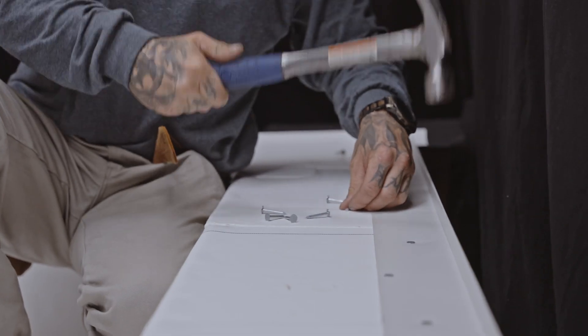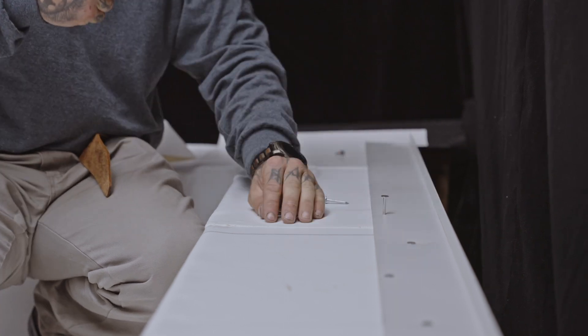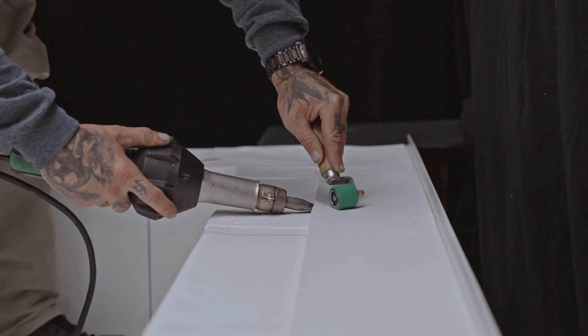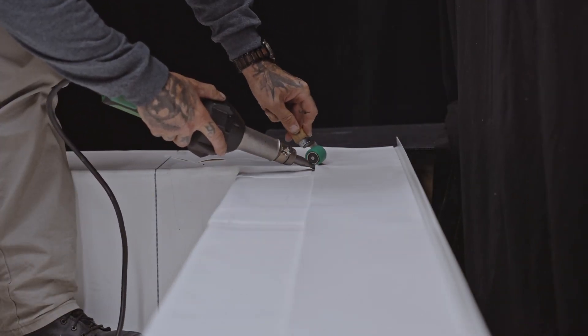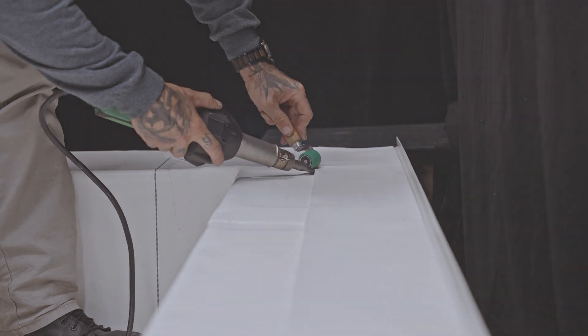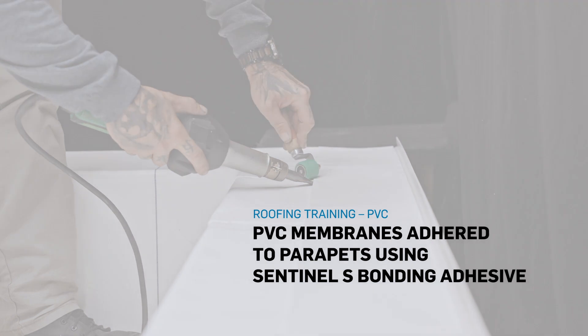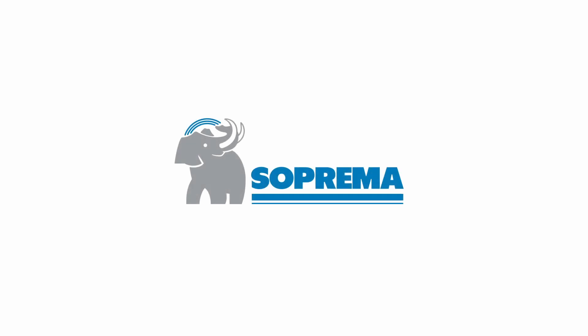Finally, at the top of the parapet, attach a PVC-coated metal flashing. Weld a strip of PVC wide enough to allow a 38-millimeter continuous weld to the parapet membrane. These were the installation steps for adhering Sentinel PVC membranes to roof parapets using Sentinel-S bonding adhesive. To be continued.